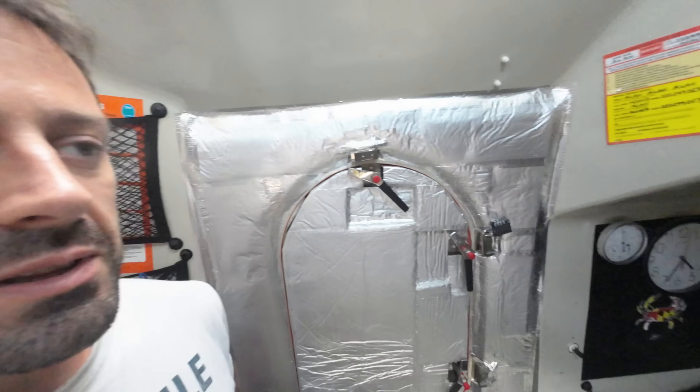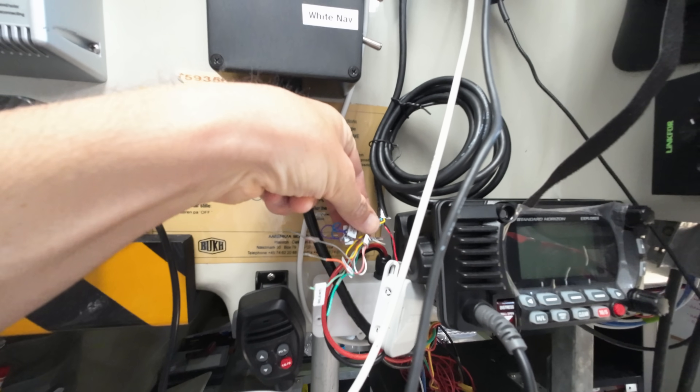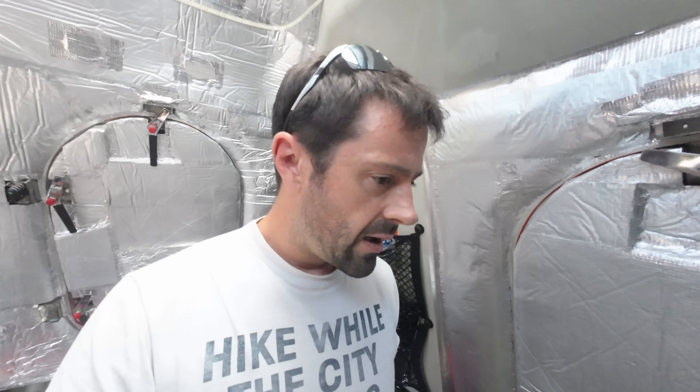All the continuity testing was as it should be. The problem was these little cables that come out the bottom of the power cable, which head off into various electronics circuits depending on what sort of other devices you're going to link the unit to. And the two silent cables — silent negative and silent plus — had been twisted together and sort of bundled as a pair.